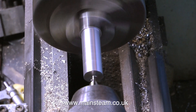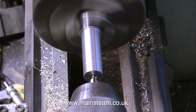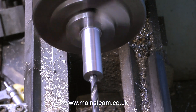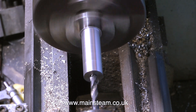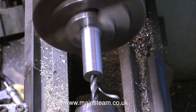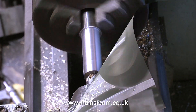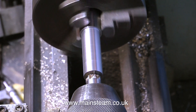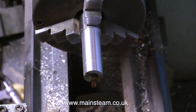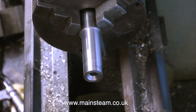What I now need to do is make some special washers, so it's over to the lathe with a piece of silver steel in the chuck. I'm using a centre drill followed by a twist drill to drill a hole all the way down a section of the silver steel. The idea is to make some special countersunk washers. The hole I'm drilling is clearance size for M6. I've drilled the hole about two inches down into the silver steel, and now I'm countersinking the end and oiling it, because the countersink is screaming a little bit. I'm actually using steam oil as a lubricant.